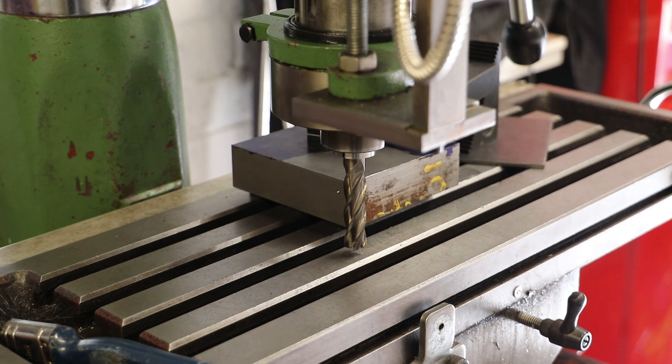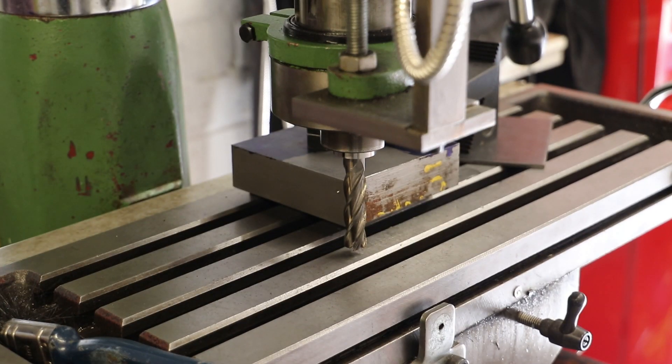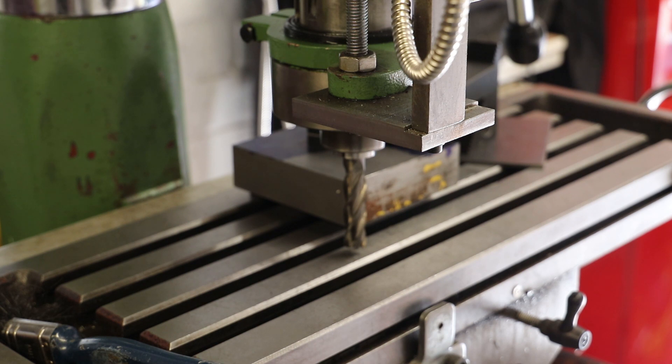For the top plate I'm going to square it off first in the mill before thinking about how I'm going to hold it in the four-jaw to reduce its thickness. The first cover I've done I've positioned it fairly square — I've run the dial gauge along the reference side, it's pretty square to the mill but not quite perfect and I'm seeing a little bit of undulation along the surface. So I'm just going to run a very light cut along this face and then also clean up this face, so I'll have those two faces clean and square before I do the other two sides.